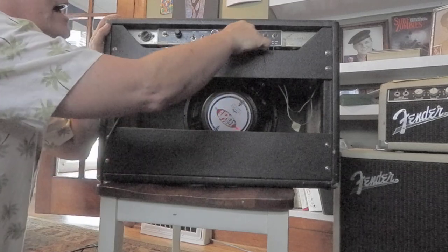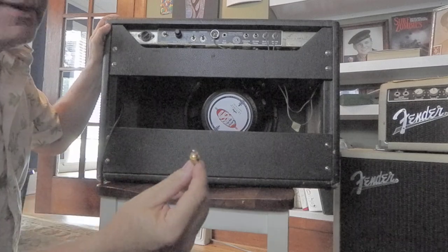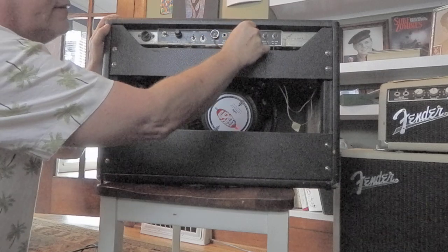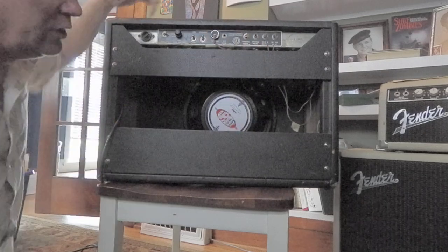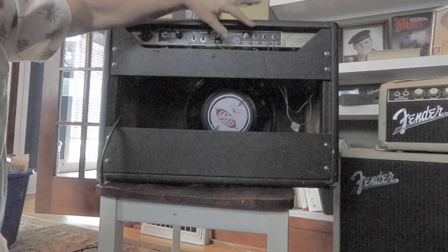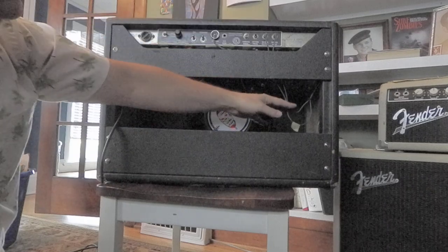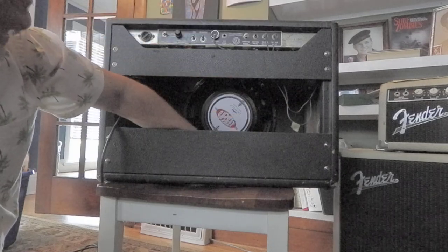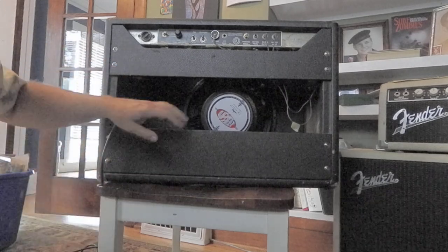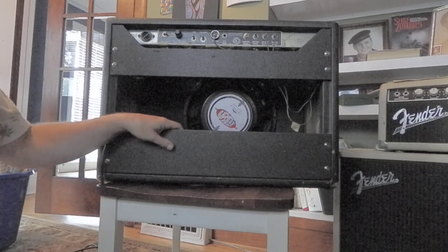Your vibrato — what I've got is an RCA male jack that's been shorted out. I just stick that in the vibrato side so then I can control the vibrato on the front by hand. Reverb's always on. Here's your reverb output and reverb input that goes down to the reverb tank sitting down here — it's an Accutronix. And that's a spring reverb, not digital, of course.